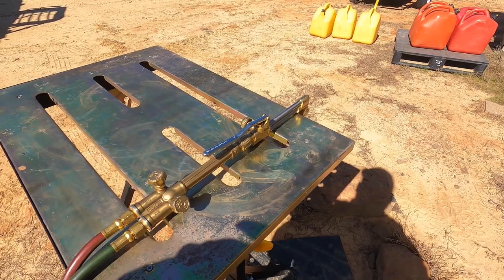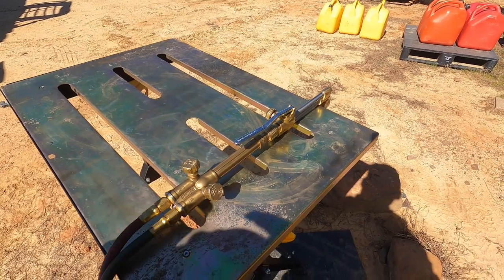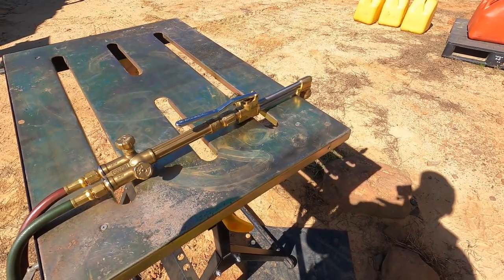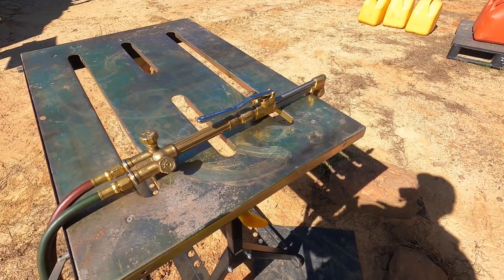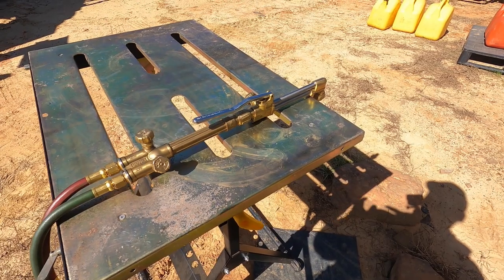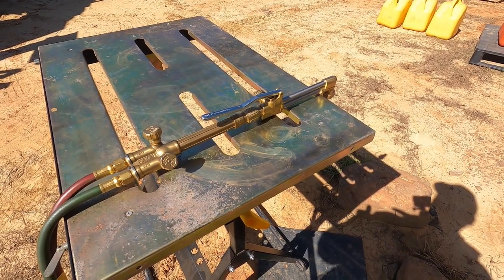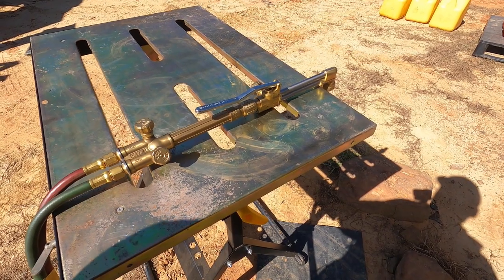Your lines can start leaks, become explosive, whatever. I'm not a scientist, I just know the gist. You can research it if you want to know more about it. But flow rates for acetylene matter. So when you're doing something bigger and you need to flow a lot of gas to create a lot of heat, whether for cutting or using a rosebud to heat something real good, propane can be a great option because there's no restriction on flow rate for it. So that's why I use it.